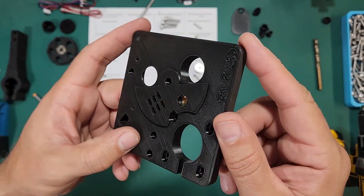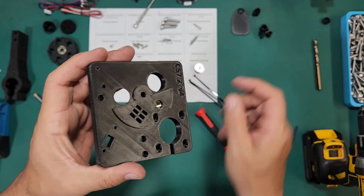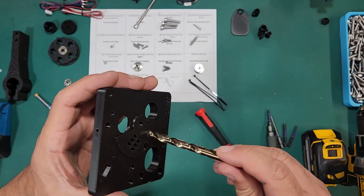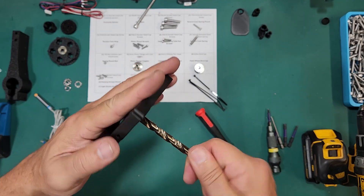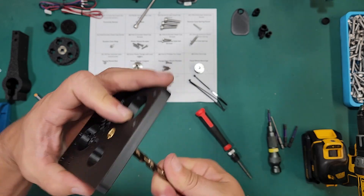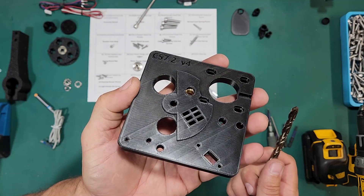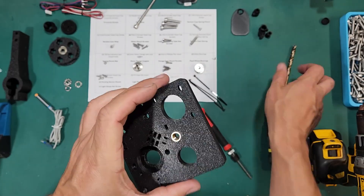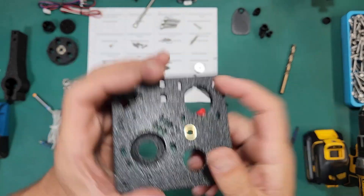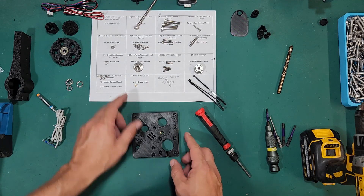This one actually has a little bit of melted plastic on the left side. So I'm going to get my drill bit — this is an M8 drill bit — and just ream it out a little bit to get rid of some of the plastic. We don't want that plastic interfering with the proximity sensor; as you try to thread it up it will create a problem. But now that it's in there flush, we can continue on with our build.